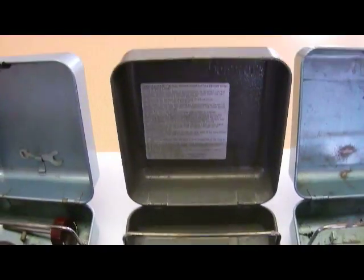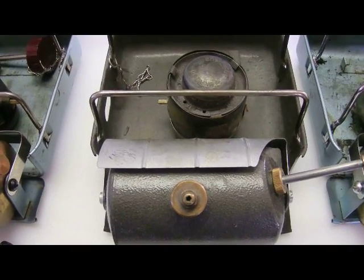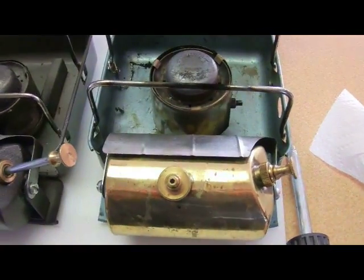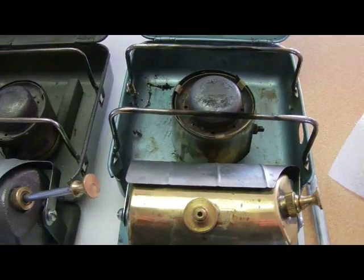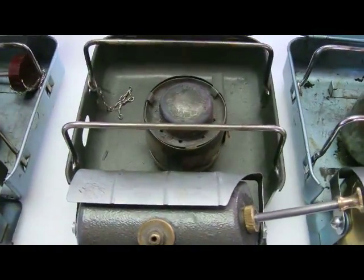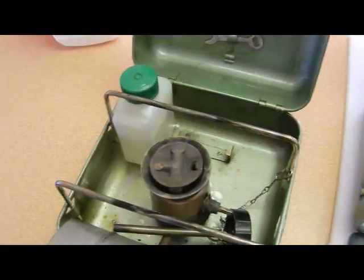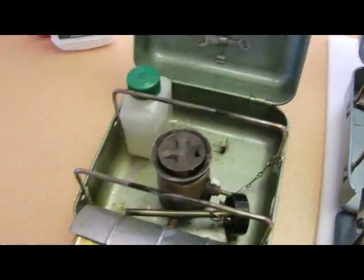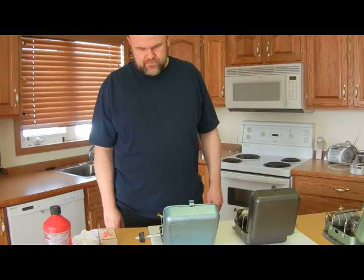Next is the 111C, which has a Cobra burner and is set up as a multi-fuel — it'll burn white gas, kerosene, diesel, and alcohol with a restrictor. Then there's the 111T, which is also a triple fuel — that's where the T comes from — though it doesn't burn diesel well. The originals were Roarer burners with a little more power. We're going to race the B against the original 111, and race the C against the T.